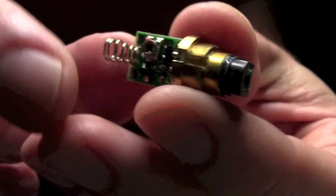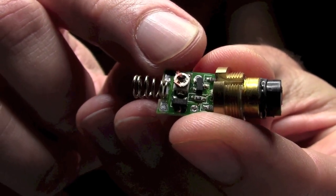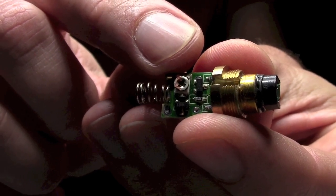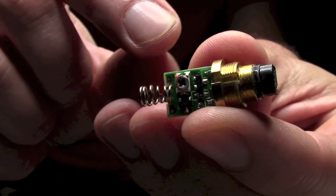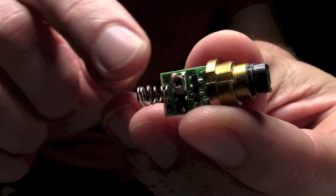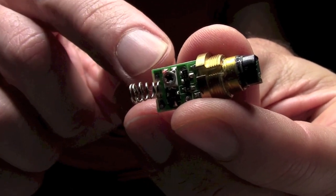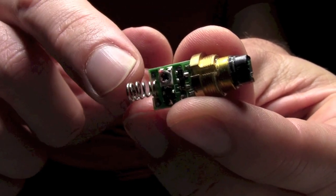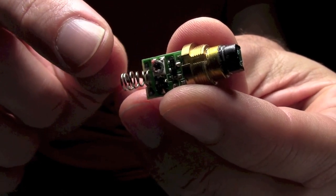But that's not the interesting part. The interesting part is that on this circuit board there's a little Phillips head screw — probably a potentiometer. If you turn that screw it changes the laser output. There are no positive stops at either end of the adjustment range; it just continually turns 360 degrees. So the only way to know you're adjusting without going too far is to hook this up to power while you're doing it.